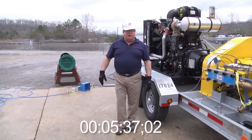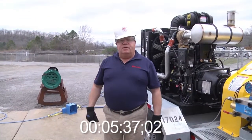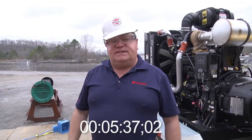We have now just completed a complete safety check on a water blast system for lancing tubes. Now that we've set up the job, we're going to be doing some tube lancing. Alan is going to be lancing scaled tubes. We've already checked to make sure all the tubes are open. However, he will be using a handheld anti-withdrawal device because sometimes on a job, it's impossible to tell whether the tube is open or plugged.